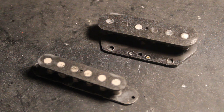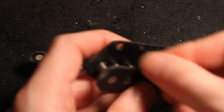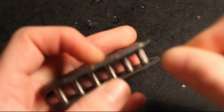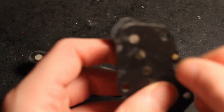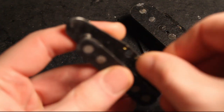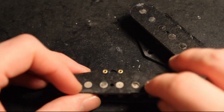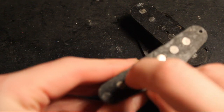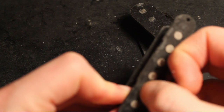About a week later, all the lacquer is completely dried and these are ready to wind. The first thing we need to do is — because the lacquer tends to block the eyelets — grab a pin and just prick it through each of the eyelets and wiggle it around a little bit to open these up. We need to make sure there's no lacquer blocking them because we're going to put the wire through here and thread it through those. After that, check the bottom — if the flatwork is flaring up around the edges, scrape off as much as possible until you've got a completely flat bottom.